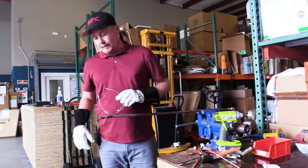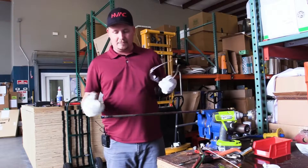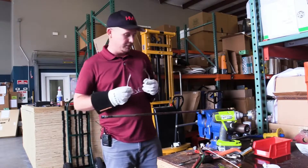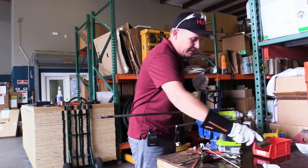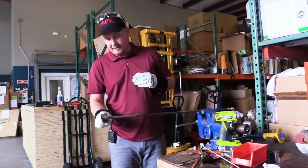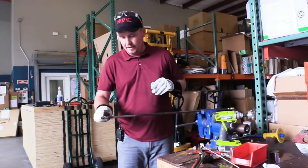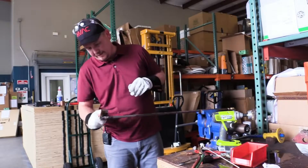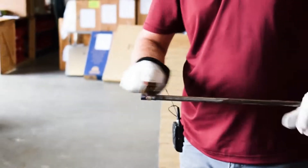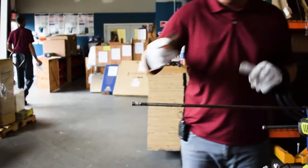Normally you want to let this cool down by itself for maximum strength, but I'm going to cool it down now just for demonstration purposes to show you how the finished joint looks. I'll take a steel brush and brush it off with a little water, because I used an acid flux and you do want to clean it off when you're done. Anytime you're using a corrosive flux, just go through and clean it off — but again, wait until it fully cools.